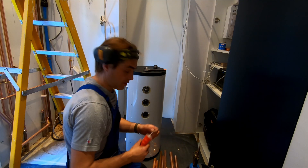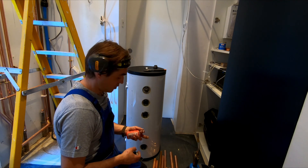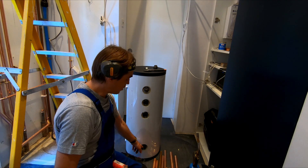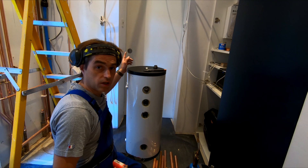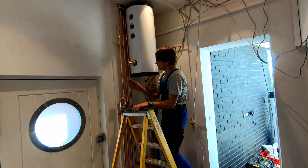I'm assembling what's called a buffer — it's like a big low loss header with 45 litres of water. It has four connections on one side and two on the other. The return from central heating goes to the bottom connection and comes back on the other side at the top, back to the heat pump. There is a T before it goes to the heat pump coming back from the cylinder, so the buffer is only on central heating.